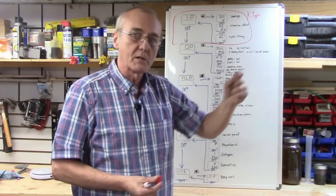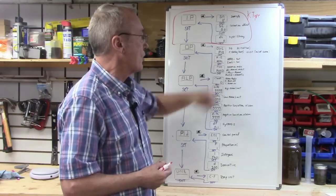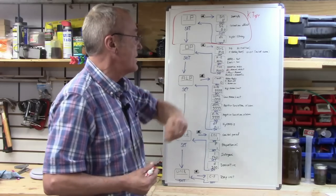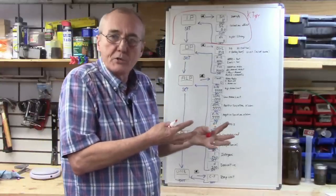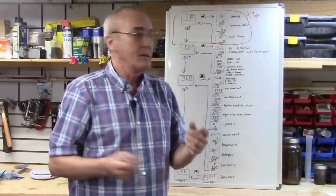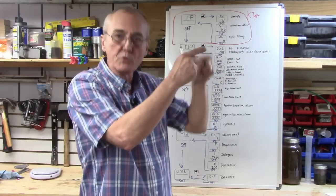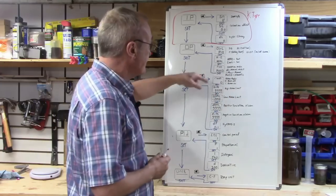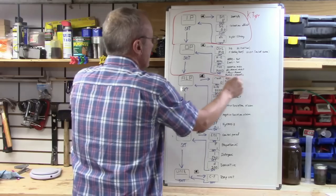Push set and the next page is HC — heat or cool. It normally comes set to heat; change if needed. Push set and the next page is RUN, the operation mode. We want ours set to auto — we want it to automatically do what we tell it. Your other options are DN (manual inhibit) or manual mode where you can adjust power output percentages. Leave it at automatic and let it run. Push set again and you return to OP.